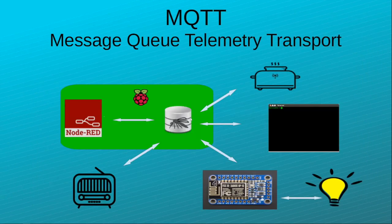Now, and here we go. We're going to put it all together. So, using Node-RED, MQTT, and an ESP32 with Tasmota firmware, and a web page, I'm able to create automation based on the time of day, events like weather prediction, or input from a browser to control lights, in other words, manual. I can monitor devices, and I can use Node-RED to display the information as the gauges. I've showed you that. And or to use the information to control devices.